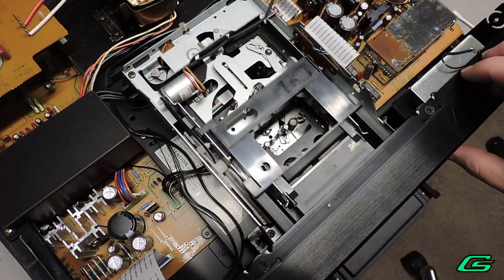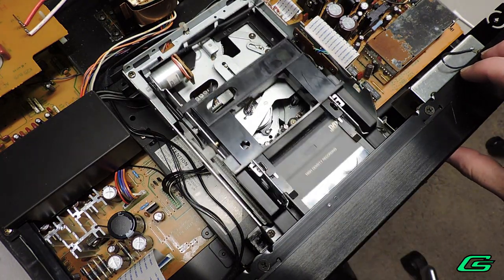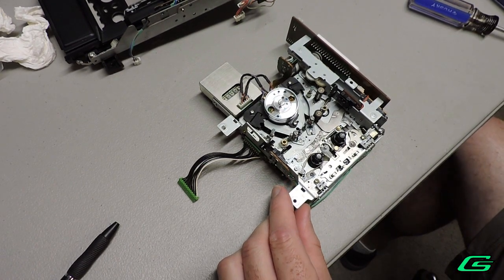Testing the unit again, there is no change. The spools aren't giving any slack for the take-up rollers to pull out the tape, and the grinding sound continues. That leaves me more interested in why the spools aren't turning. It seems to be where the grinding mechanical sounds are coming from.